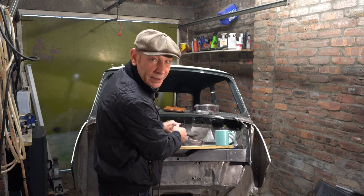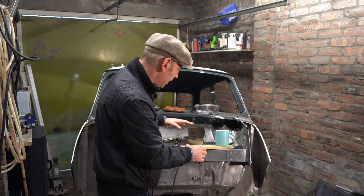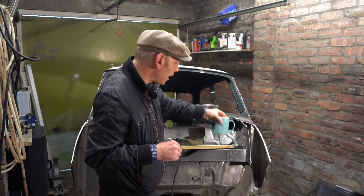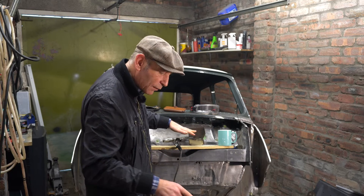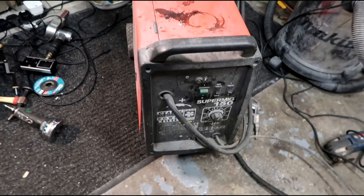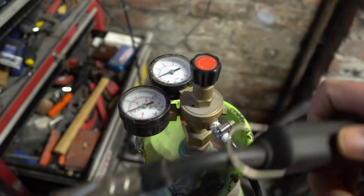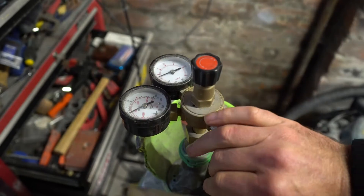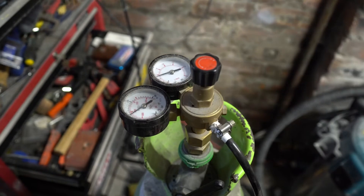Your wire speed — the setting I've got, I'm going to get this to sit now. I've got my setting on one minimum; obviously I don't want to put too much on there. And I've got my pressure from my argon gas — when you squeeze the trigger it goes down just above two. You just hear a small puff; you don't need any more than that. Set the pressure about that — that's my personal recommendation anyway.